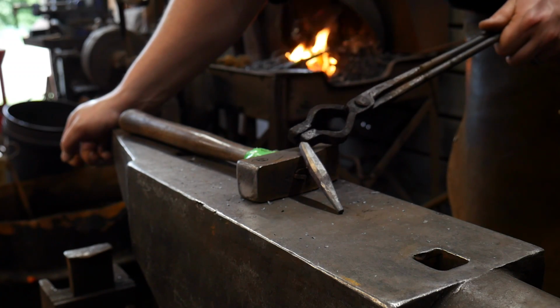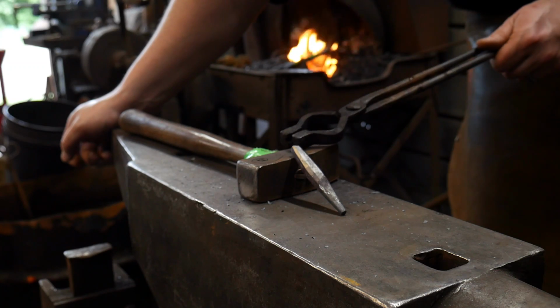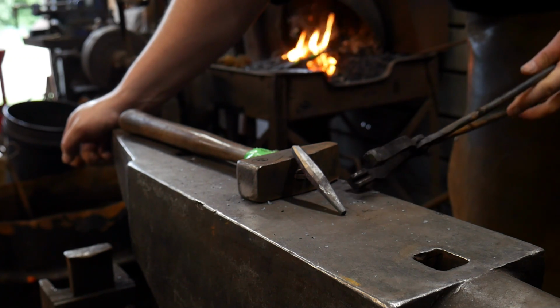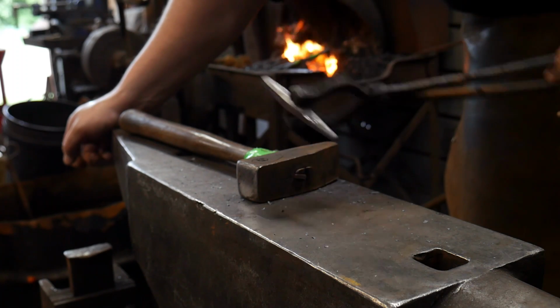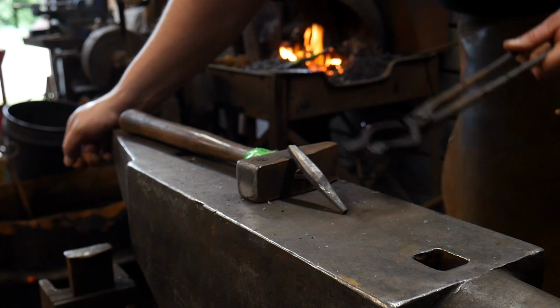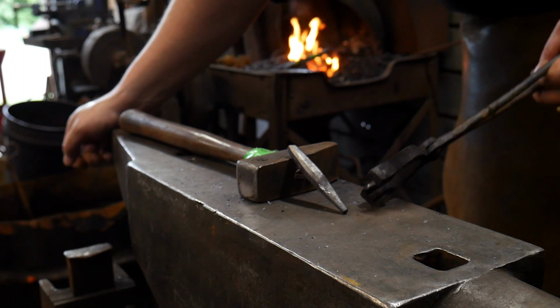This over here on the struck end, I've taken it down to 3/8 of an inch, and I'm going to go ahead and back it up to roughly about 7/16 of an inch or so. Not quite 1/2 inch, it'll be that middle stage in between. So that's basically the shape that we're wanting. This makes a really good, strong, stable tool.